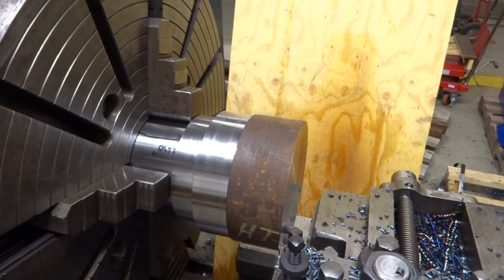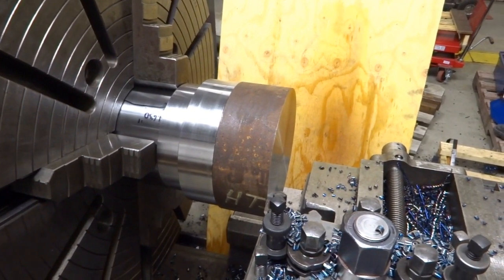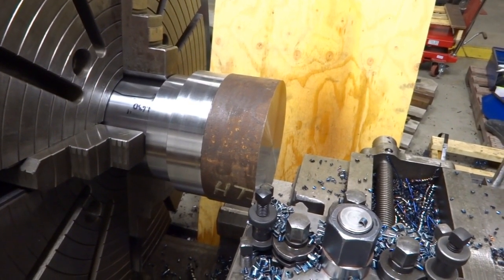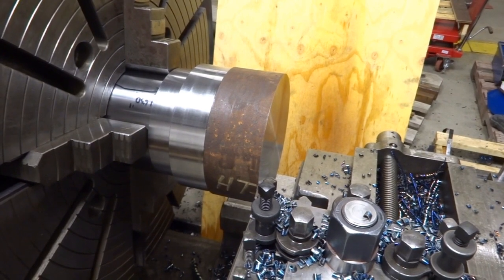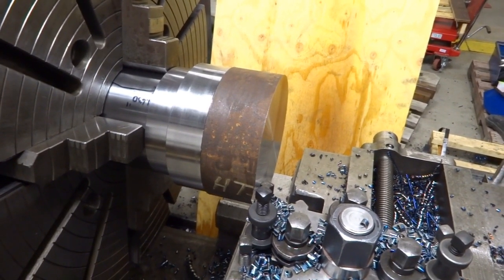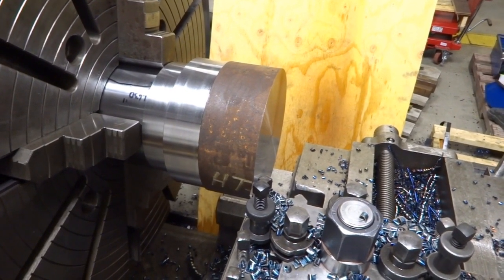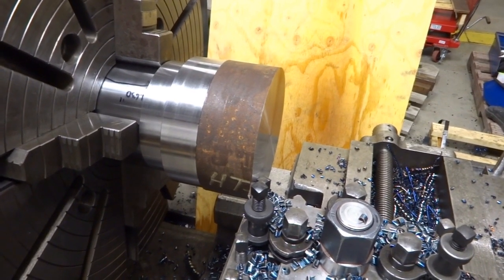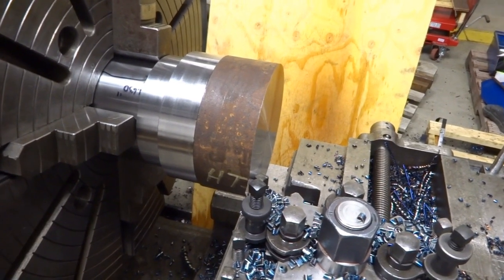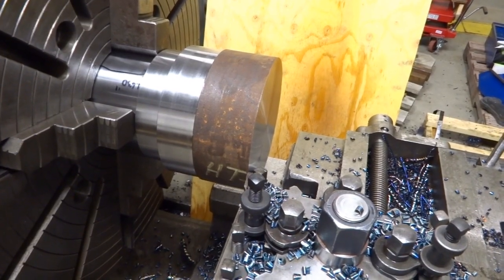After I did the cut, I decided to see what kind of horsepower that cut was taking. It turns out the metal removal rate was about 46 cubic inches per minute. I went on KennaMetals' website — that's not whose insert I'm using but that's whose information was available. For roughing with carbide inserts in 4140 heat treated stress relieved, they use a specific horsepower of 0.77 horsepower per cubic inch per minute. Using that metal removal rate gives you a horsepower of 35.7 horsepower.